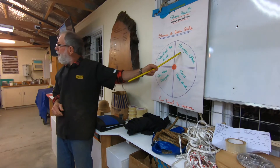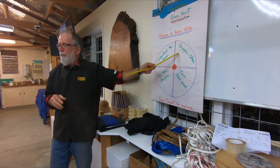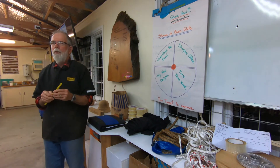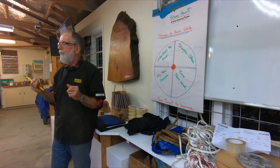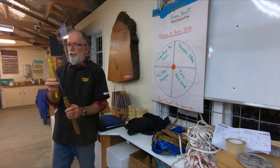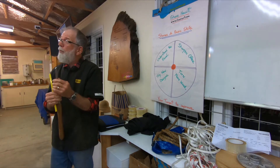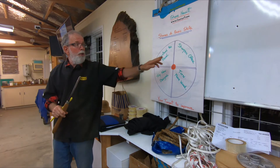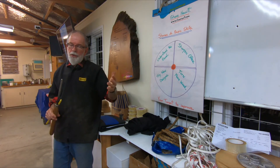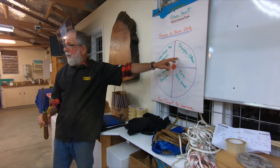The next one is: sharpen often. Nearly everyone I've taught for many years is absolutely afraid of the grinder. They're afraid of ruining the tool, of making it worse. You pay a hundred bucks for a tool and you don't want to think you've wrecked the shape of it. So everyone is pushing to get better but they're not sharpening anywhere near enough, which means sharpening is left aside, they're trying to get clean finishes with dull tools, and therefore they're sanding too much.